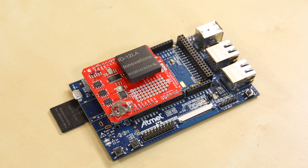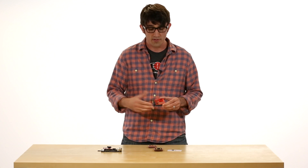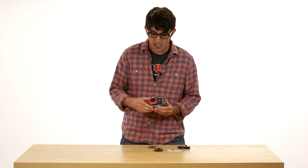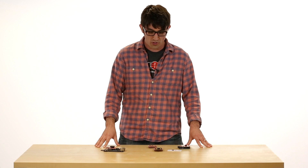We've worked to make this shield work with a bunch of different platforms because the Arduino R3 form factor works across a whole different ecosystem. It works with 5-volt Arduino boards, and we have onboard level shifting for either 5-volt or 3.3 volts. It also works under Linux — for example, here is a SAM A5D3 Xplained from Atmel running Debian, so you can use all the Linux software I wrote for these chips. There are a bunch of other compatible boards listed in the hookup guide.